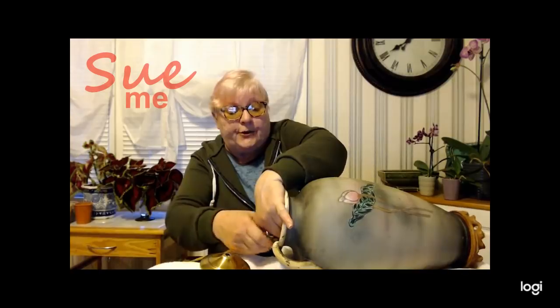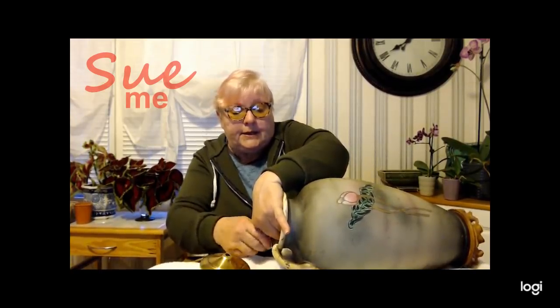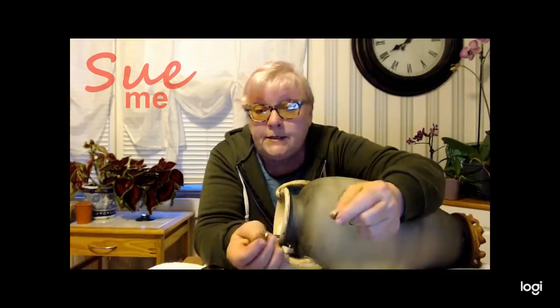This is the fitting that got sheared off in the break. I had considered whether or not I wanted to replace this fitting with exactly the same kind of fitting — here it is, two pieces right here. I decided I was going to replace it with exactly the same fitting. The reason for that is I'm going to treat this like a stress crack in a sidewalk. The vase didn't break — that was a good thing. The shade got racked but not damaged — not so bad. This is a 30-cent fitting and this is where the stress hit hardest. So my hope is that if I put the same fitting back, if the lamp falls again, it'll break in the same way — a 30-cent fitting that can easily be replaced.